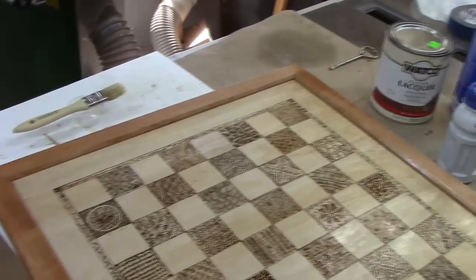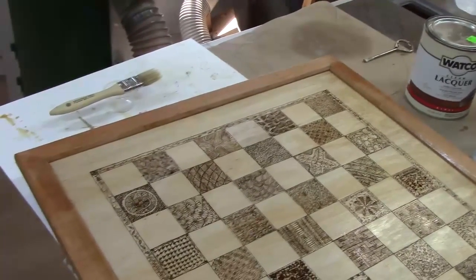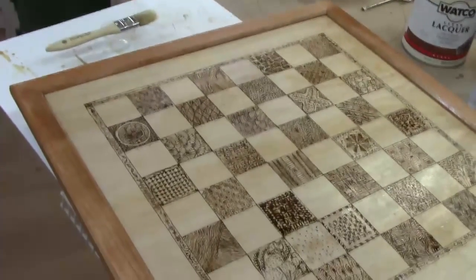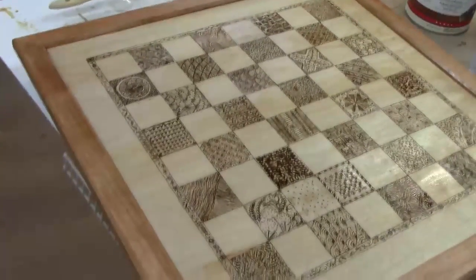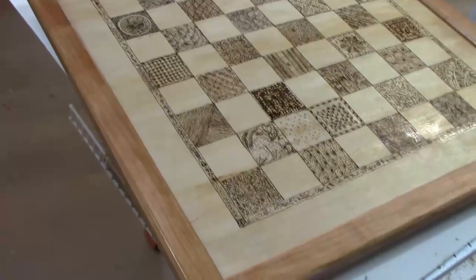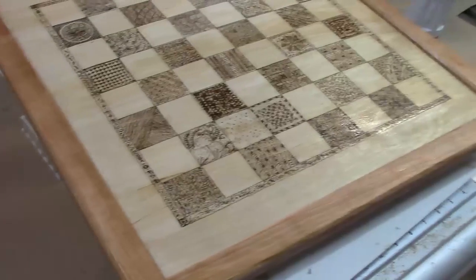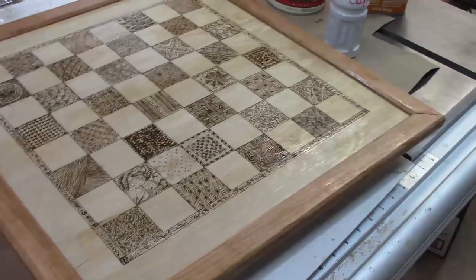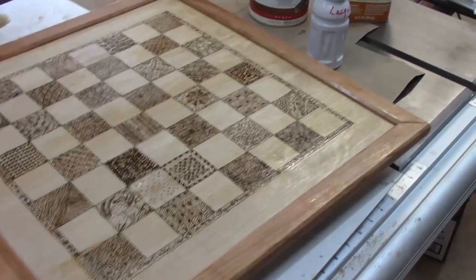Later, after drying, I brushed on another coat of lacquer full strength, waited about 2 hours, brushed on another coat of full strength, and waited about 6 hours, and then lightly sanded with 320 grit before brushing on a final coat. I'll probably sand again with finer grits after it cures for a week, and then put on a coat of wax.